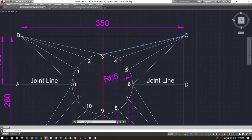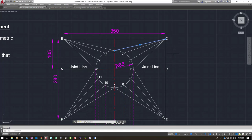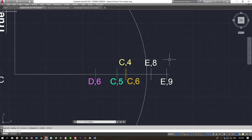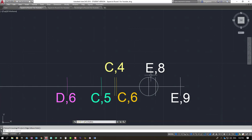You can do that with AutoCAD — you can scribe a line and put a little arc on it, but I find it cumbersome so I just draw circles. The missing line is C3. Turning the properties on, it tells me the length is 179.51 millimetres. So I come down to that line, type 'C' for circle, enter 179.51, and draw a small 8mm circle. Then I trim off the large arc that goes across the drawing. I colour-code those and put them on Hidden Detail.